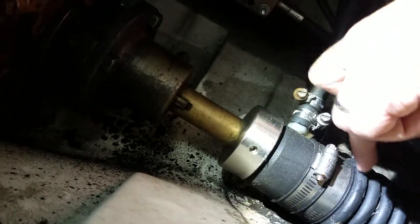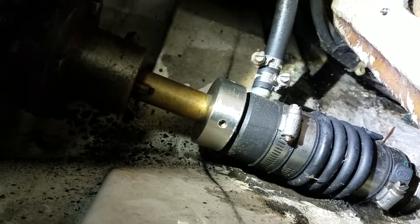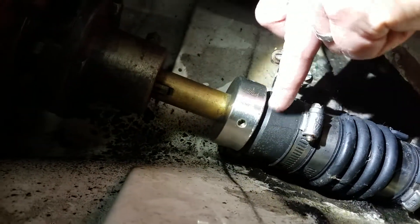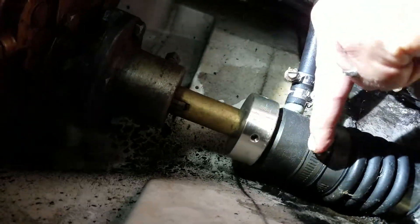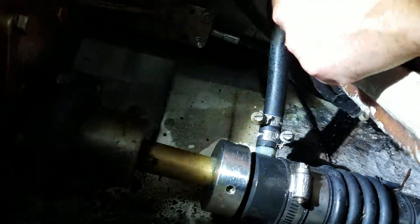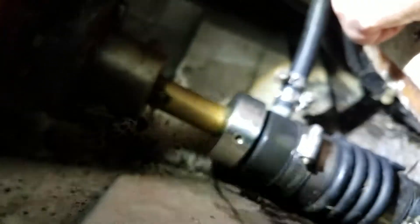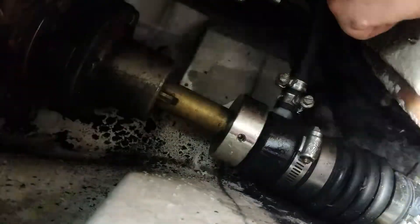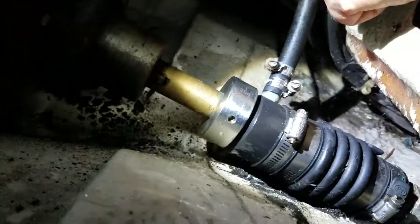What you do — this thing is really neat how it works. The silver rotor mates right up to that black piece. Take that hose and, not with a lot of force, push back on that back piece towards the back of the boat — or push sideways. See that? That's seawater. That's all that thing does — it just rides right there. The old style didn't have that tube in it, and you'd have to burp it every time you hauled the boat because you'd get air up in there. It needs to stay wet.